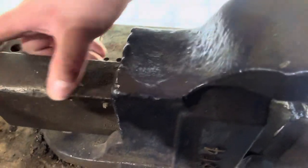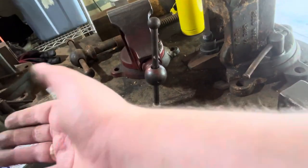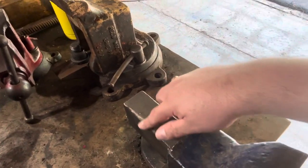On my 614 here you can see this is bent in — someone used this as an anvil. This shelf area was not really meant to be hammered on, even though it has a hardened anvil plate. This often causes damage to these vises, especially when we eventually talk about Prentice. That area tends to split a lot on Prentices — it's actually known as the Prentice crack, it's so endemic to anything Prentice made.